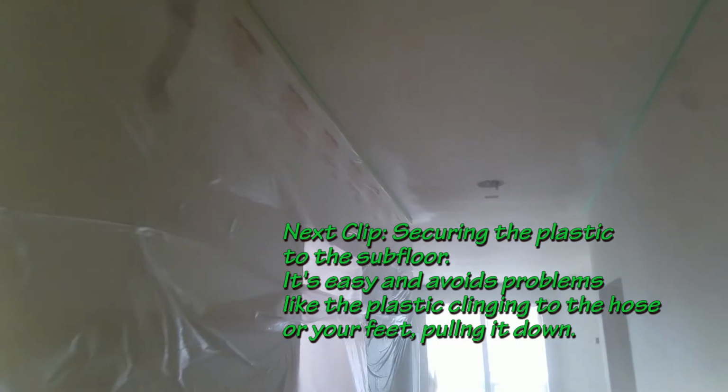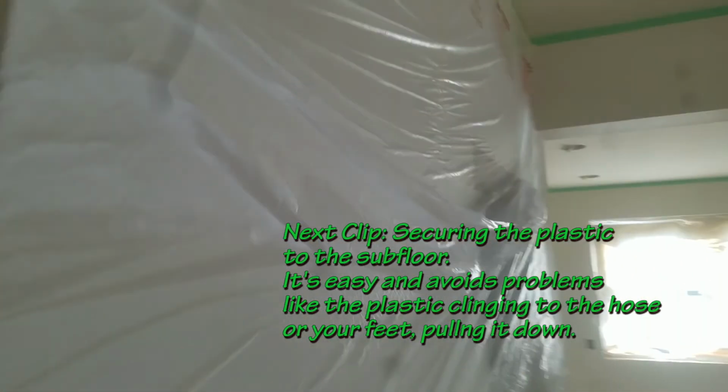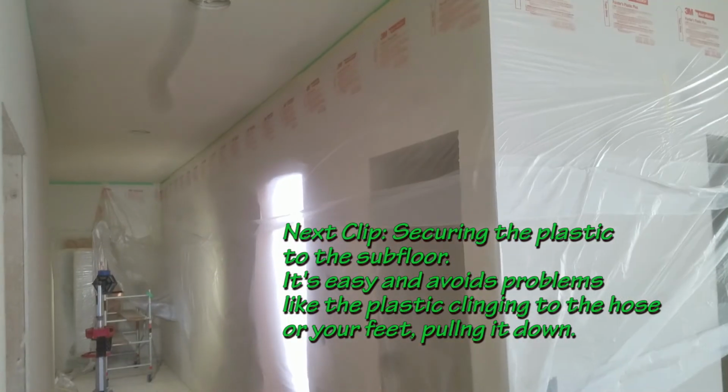Like this on both sides, and that will hold your plastic down because we're shooting with an airless sprayer, a minimum of 2,000 to 2,400 psi, so that plastic will just billow right upwards, but not when you have these things holding it down. And we can even do that further down on the wall. Okay, thanks for watching my little tutorial on plasticking off interior walls to spray ceilings. Thanks for watching, guys. Have a good day.